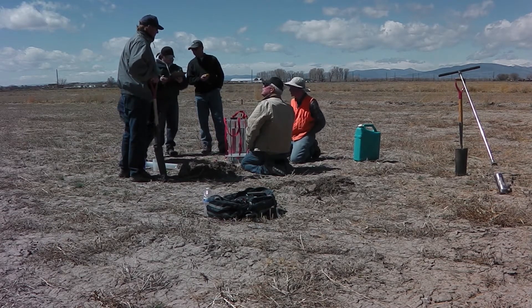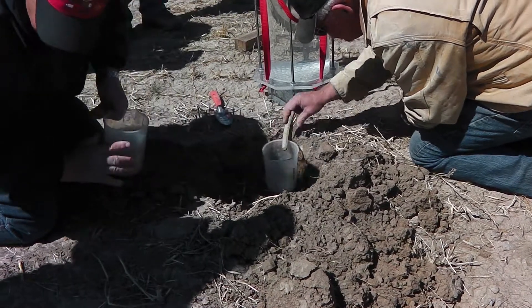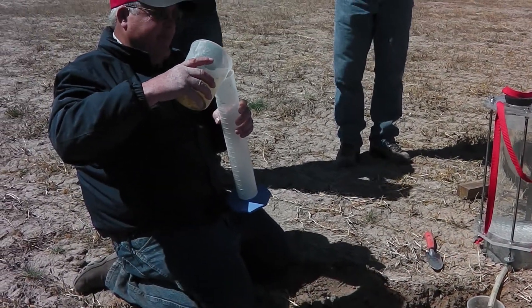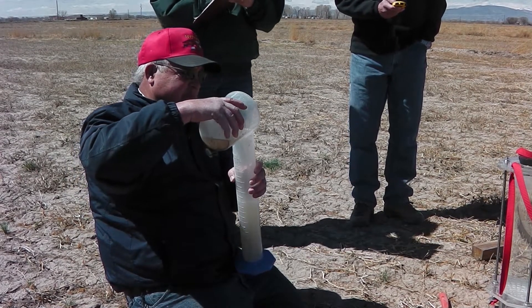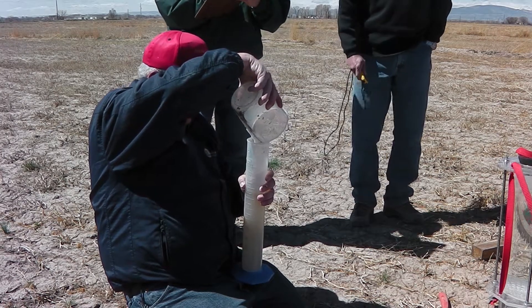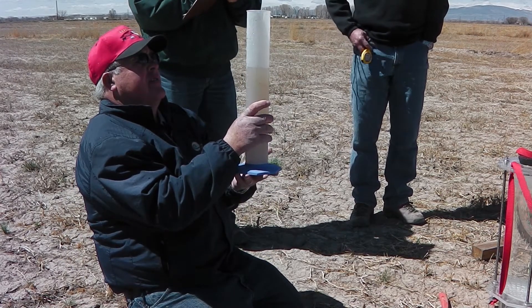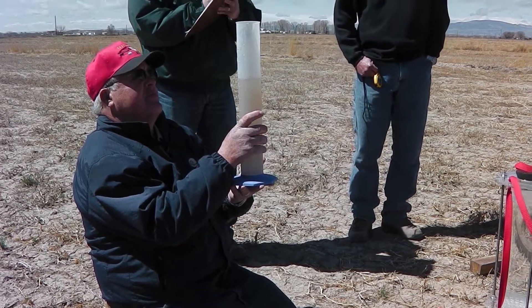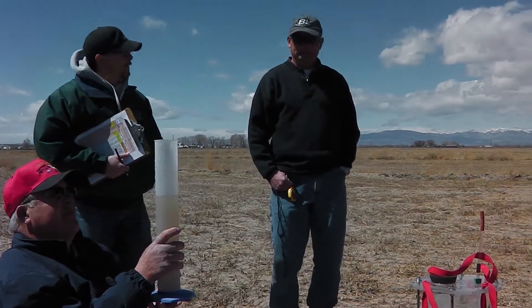The depth of water is greater — you can see that almost all the water applied has run off into the beaker. As you go through successive three-minute intervals, the amount of water infiltrating goes very close to zero and the entire application rate comes off into the cup, which is the problem we were dealing with and trying to determine the feasibility of installing a center pivot on the soil that we have here.